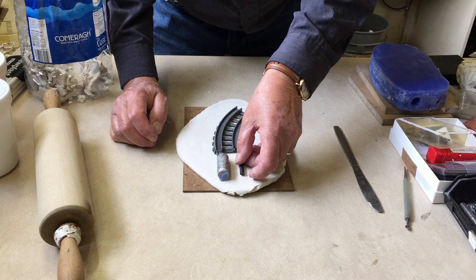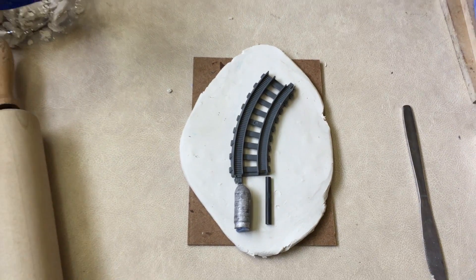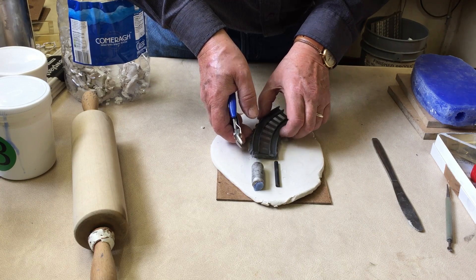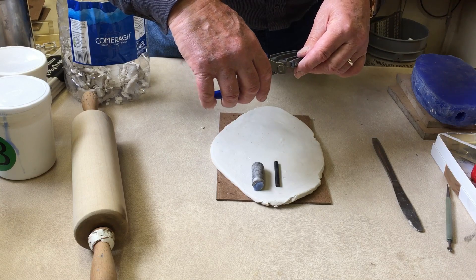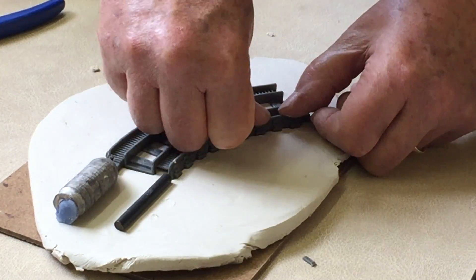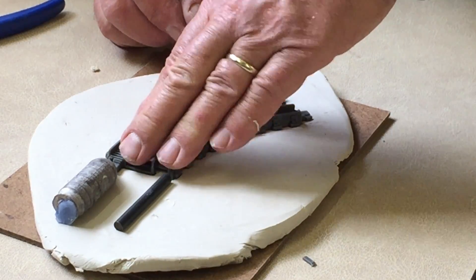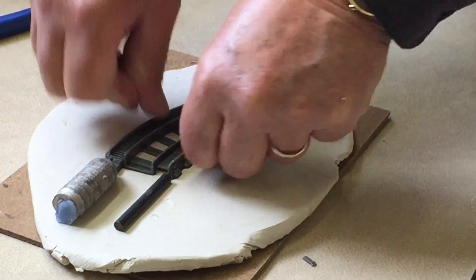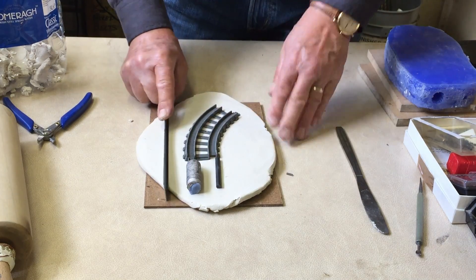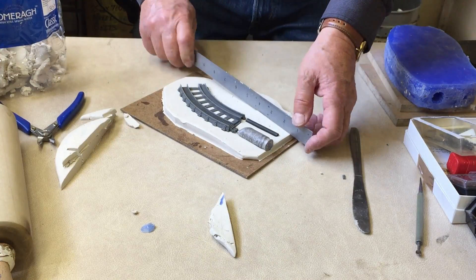The riser is just to let a gap for the air to move into and for the excess metal to flow. There are some undercuts that need to be removed from the track, as those would catch in the mould when it's been cast. These can be just cut away using flat-sized snips. Then put the track back on the clay and push it down as close as you can into the clay to avoid any gaps. Carefully make sure that it's firmly positioned. Now we're going to be cutting away the excess clay — you can leave about 20 millimetres all around at least.